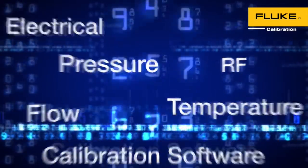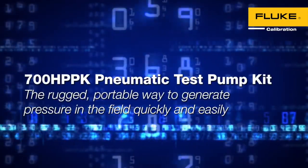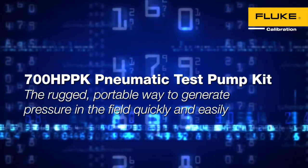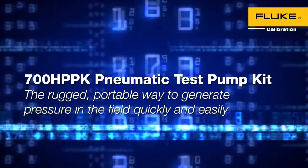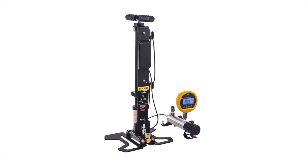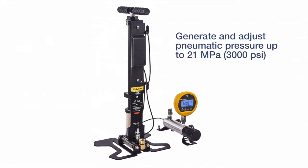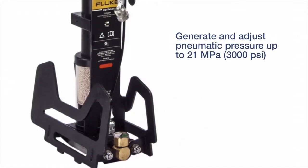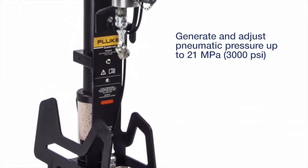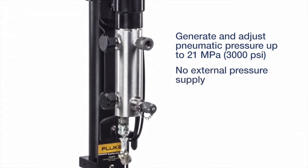700 HPPK Pneumatic Test Pump Kit. The rugged, portable way to generate pressure in the field quickly and easily. The Fluke Calibration 700 HPPK Pneumatic Test Pump Kit generates and adjusts pneumatic pressures up to 21 megapascal, 3000 psi, without requiring a nitrogen bottle or other external pressure supply.